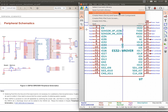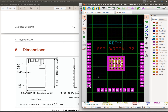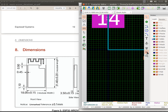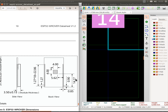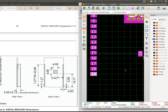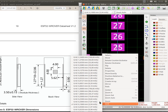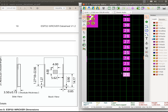Let's save our library part and move along to designing the footprint of our ESP32 WROVER module. We also use the existing ESP32 WROVER footprint as a template. The first thing I do is set the grid origin and also set the grid so we have the spacing needed from the datasheet. For the ESP32 WROVER module we need a spacing of 50 mil or 1.27mm. Now we move the pins to the locations where they are on the WROVER module — five from the bottom going left, and the other five going to the right side. We also place our grid origin again for the right side, switching between 0.1mm pitch and 1.27mm pitch.